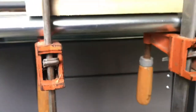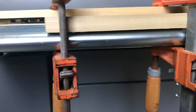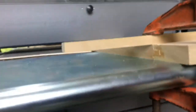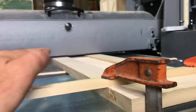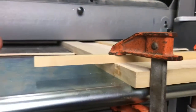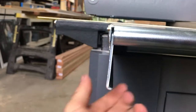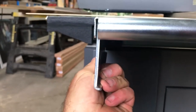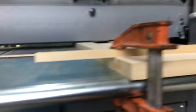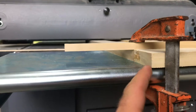The problem was I was trying to adjust it but I can't hold it with one hand while tightening bolts with the other — it kept getting all catawampus. What I finally figured I could do was put a piece of stock in the sander — actually one of our doors — so it's level on the belt and sticks out. Then I loosened all four carriage bolts, two on each side, pulled this frame all the way down, and clamped the table itself back to the work piece to hold it up.